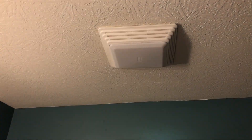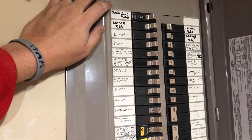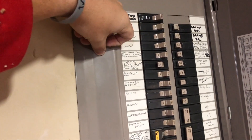The next step is to turn off the power. I'm going to the breaker box - I could have just turned it off here but I really want to make sure there is absolutely no power. So go to your breaker box and be smart about it. At the breaker box, look to find out which one it is - we're looking for bathroom. I believe it's this one right here, so move it away from the center. Test to make sure it worked - it did turn off. Make sure you do not have power going to it.